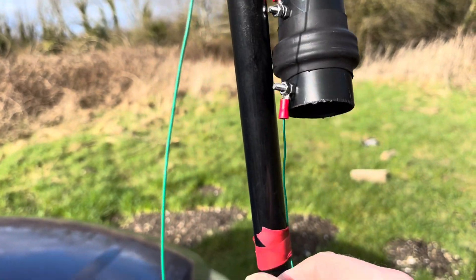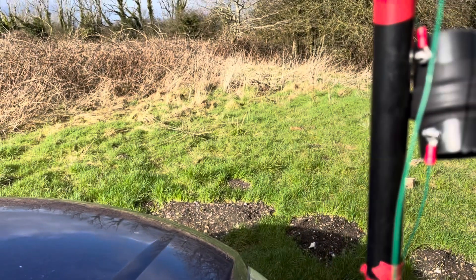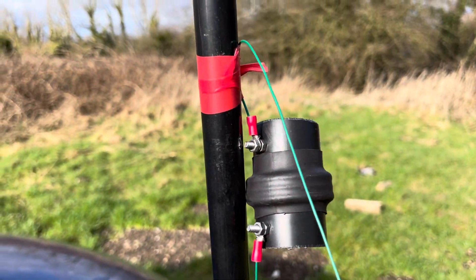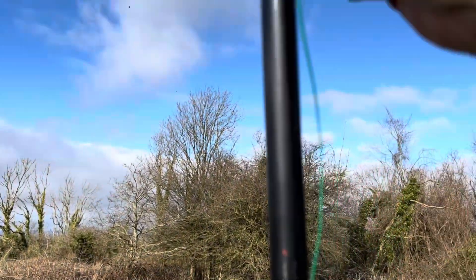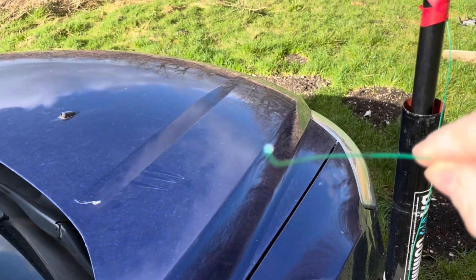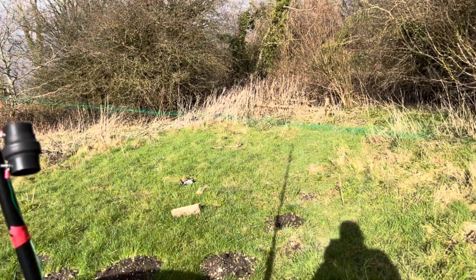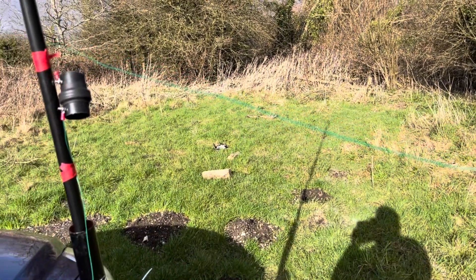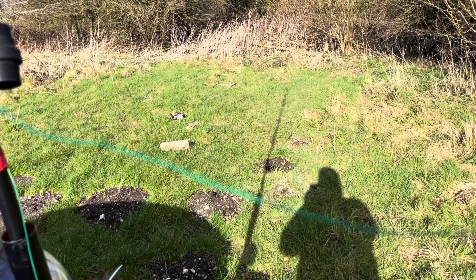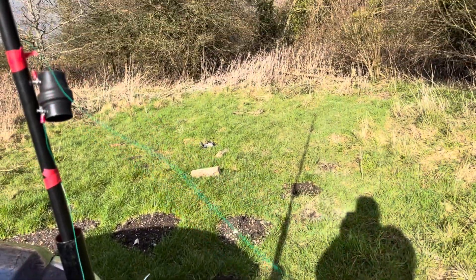Below that is the 10 meter element. This trap is at about 4.7 meters - I'll measure it properly. Look how short the tip of the 15 meter part is - literally that's it, that's how short it is. So we're nearly there; got the resonance now at 20.5 MHz, best match of 20.5. A little bit more to go and we'll have it properly tuned.